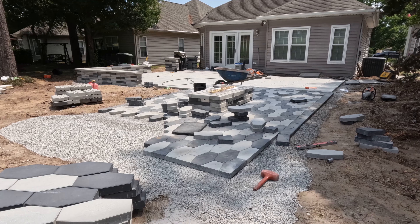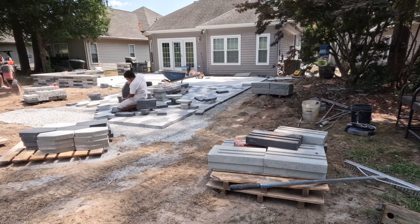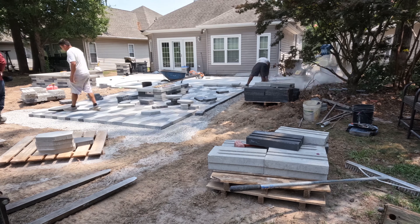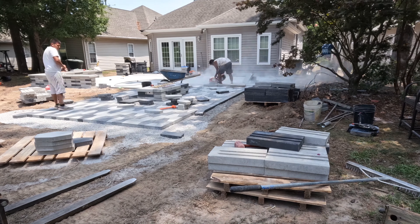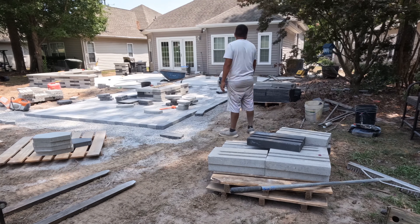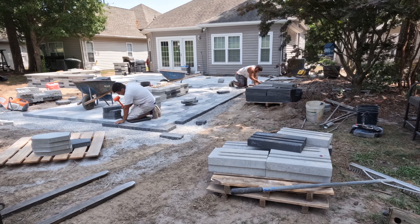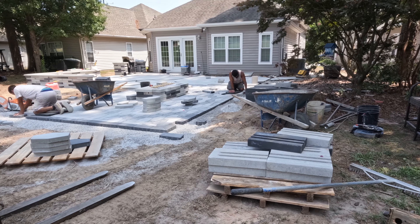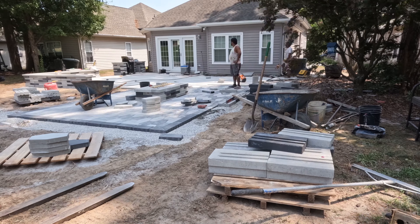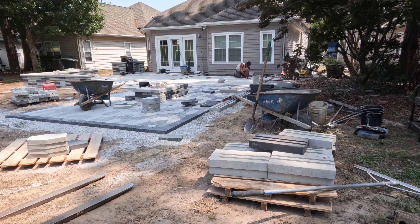I love watching pavers get laid. It's just something so satisfying about watching them create a hard surface out of nothing. About time for us to start our wall construction. Kevin is by the house cutting in where the exact wall placement is going to be into the existing pavers. The first course of wall block is arguably the most difficult because we need to get it leveled side to side and front to back. So it takes a little bit of time. We usually build up the gravel underneath just a little bit more than necessary and then use a dead blow mallet to hammer it down in place.